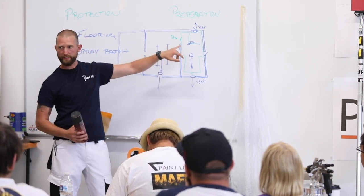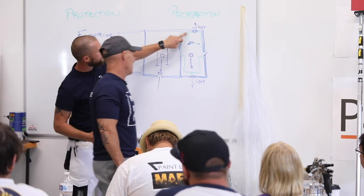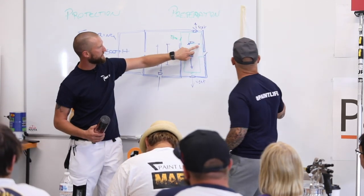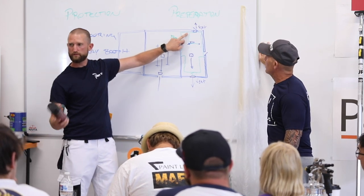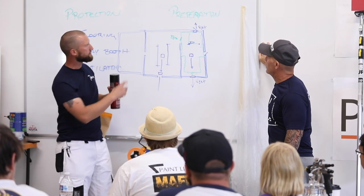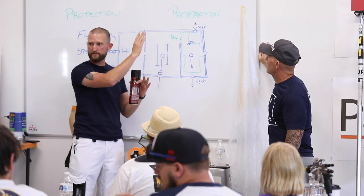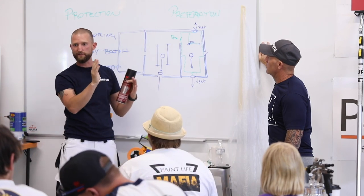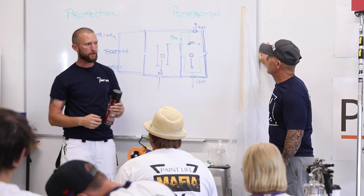We'll cut a doorway wherever we need one. We'll run plastic along the outside, cut a separate L-piece to come in this way, and where this plastic meets that plastic, we'll use Super 77 from 3M — a spray adhesive. You spray it along the plastic, push the plastic against it, and it creates a great seal — way better than trying to tape that seam all the way in.